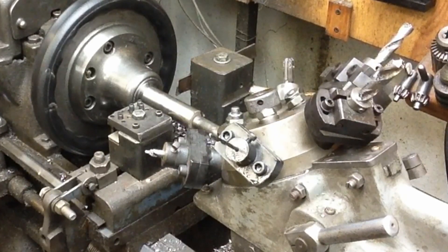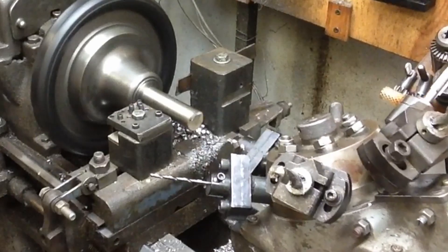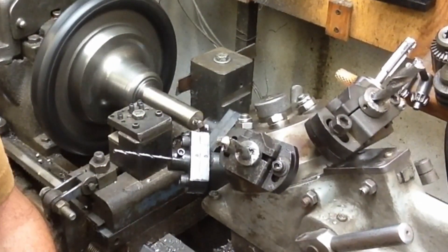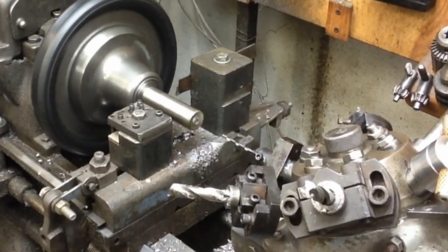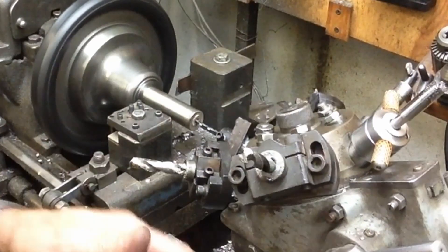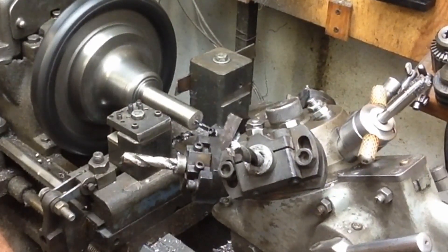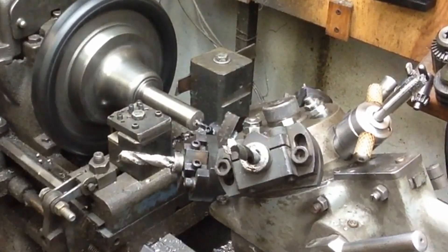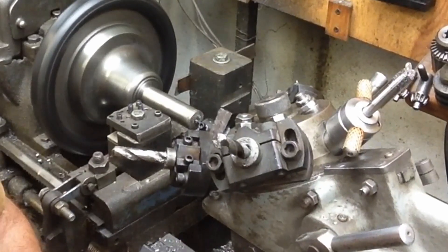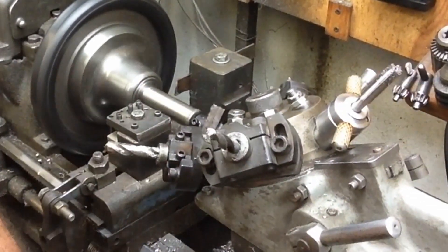On both of these drills there's a shop-built collar that I built specifically for these drills. When I've run them in the past on a standard drill chuck and a tailstock it's been easier to consistently use that collar and run your depths up to those collars. On a turret tailstock it's not necessary and not really ideal — I should have removed them. But I run this so rarely that if I do need to run one or two pieces off I've still got the collars set at depth. The downside to having those collars is they retain chips and can pack up, which doesn't give quite as good chip evacuation as I'd like. But for this short run it doesn't really matter.